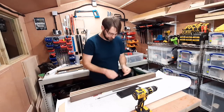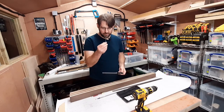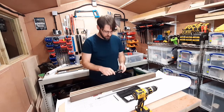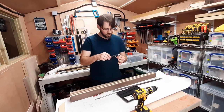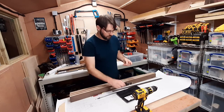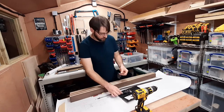Six millimeters. It's a brad point bit, but I don't want that brad point to come through the other side, so I've got to be very, very mindful of just how deep I go with this. I'm going to be very ginger and not go in very much. Nine millimeters is very little. I'm going to go eight or so millimeters, which is barely anything.